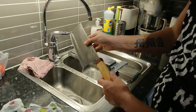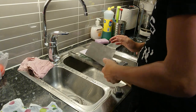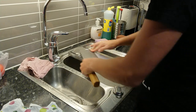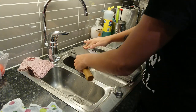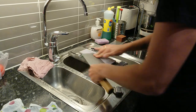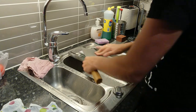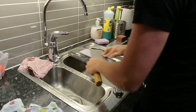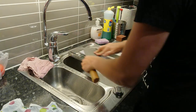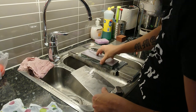You see, I'm nearly taking the hollow grinding away. That's a little of the idea, making it more flat. I tried it and I want to sacrifice a little food stiction for the ultimate performance. It already performs extremely well, but I think this will make it even better. Flipping the stone just to get an even wear.